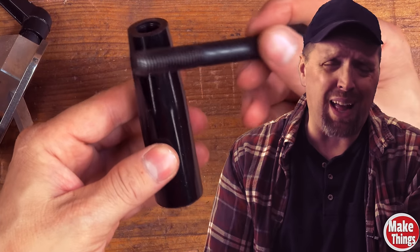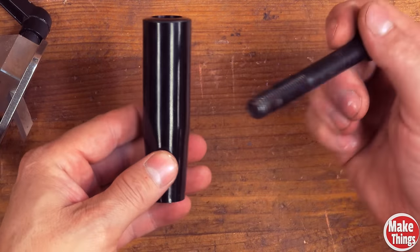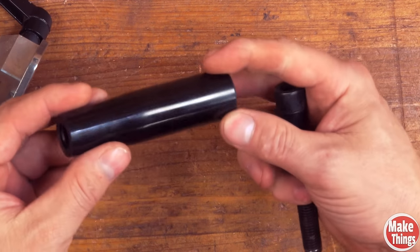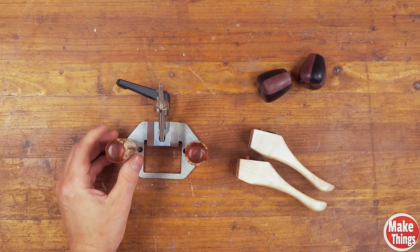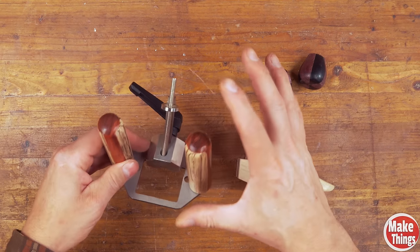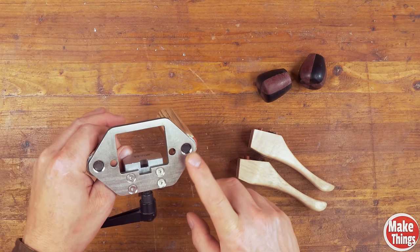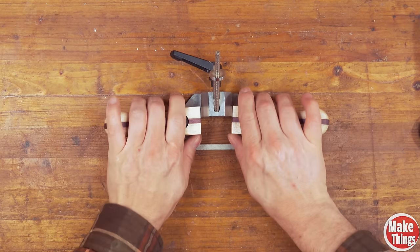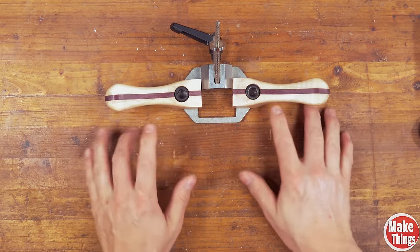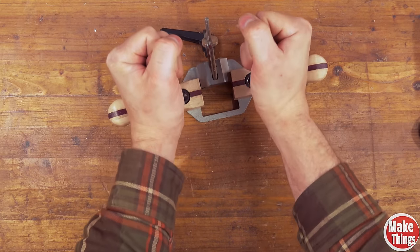With this router plane, I think the most disappointing part of this tool are the plastic handles. They feel cheap and generic. I can't imagine the handles ever needing to be replaced — they feel strong enough — I just don't like the way they look and feel, which goes against my idea that you should love every tool you own. So I made three different handle types to replace the plastic ones. What's nice about the way these things are designed, it's easy to add your own handles using an M12 by 1.75 pitch, and you can use whatever size you want. I made these handles because I wanted to have a little bit more pull — I'm not sure I love it yet, but I do like how smooth it is compared to trying to hold something like the original. It feels a little bit more ergonomic.